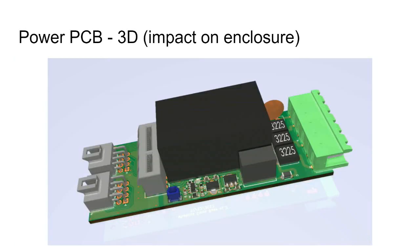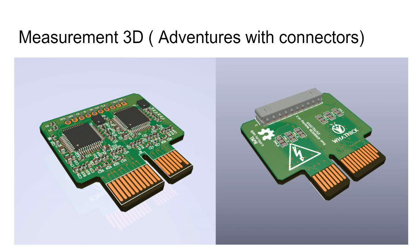It's modular. So if you decided to try a different ASIC, you could swap this out for a different one, or a new one comes out which samples faster. Or you have built something using FPGAs and CPLDs, so you could swap this out, plug that in, and sample faster if that was what you were doing. So it's designed for experimenting. It's not a production system, but it'll fit in the DIN rail.